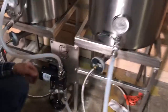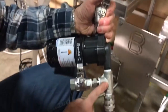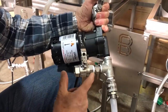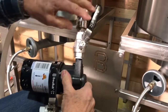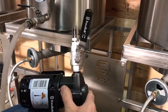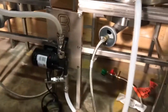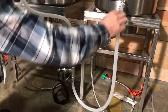Now let's take a look at your pumps. First, put your T on first, then your female quick connect into your T. The short nipple goes in the T there. Your ball valve here is for bleeding off some air if you need to. Here the ball valve for controlling the pump flow on top, with the male quick connect on top. Then your hoses — you'll have two longer hoses; they'll both go from the bottom of your pump up to the kettles.